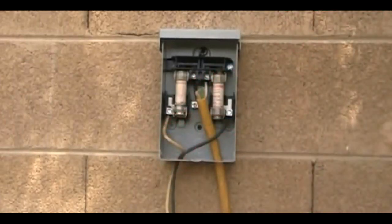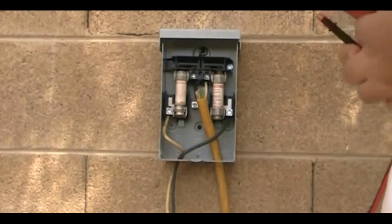If we read zero volts here, we would suspect our circuit breaker was tripped. That's pretty common — the circuit breaker can trip if you have your outdoor fan motor or capacitor go bad. The remedy for that is to turn the breaker off and back on, and that should reset it.